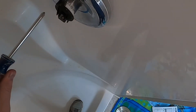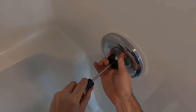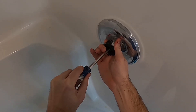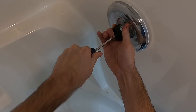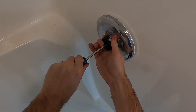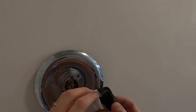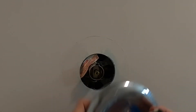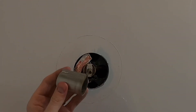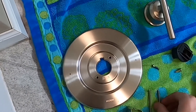If installed correctly there should be a bead of caulking securing the plate so no water enters. The underside should have a hole so water drips out and doesn't get trapped. Next we're going to take out the little black piece — the handle adapter — which has a screw right in the center holding it in. There's some resistance, so don't just yank it. Most importantly, if the water supply is still on, do not mess with the little metal piece in the middle — that's part of the valve and turns your water on. You're just removing three pieces: the black piece and two white pieces.